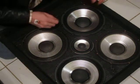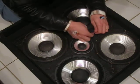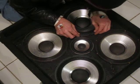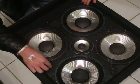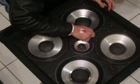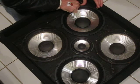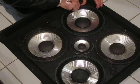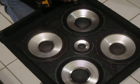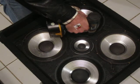Now for the new speakers. When you get a new speaker, it's going to have this little foam that extends all the way through the screw hole, and you want to make sure that you are right on top of it. This is probably where a hand screwdriver is going to come into play. If you can typically get one side and the other side started, then you got it. Just remember, not too tight.